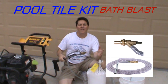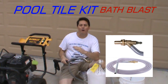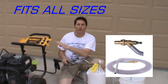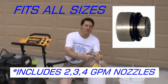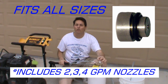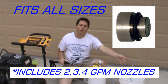The basic kit is really an accessory to a pressure washer. The nice thing about the blast accessory kit is that it can accommodate any size pressure washing machine. To accommodate the different flow rates, gallons per minute, and pressures, all you need to do is insert a different nozzle tip inside the brass mixing valve body. That adjusts the velocity and flow through the valve body, allowing you to adjust the suction needed to pull the blast media through the hose and out through the tip.